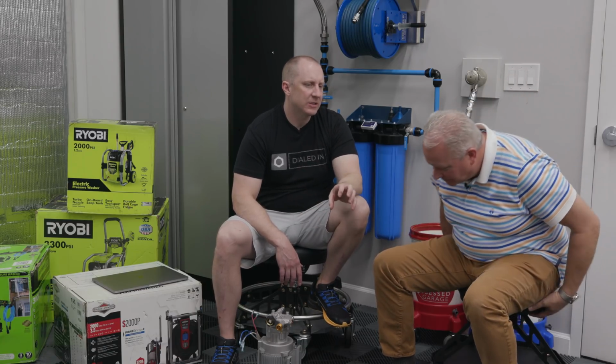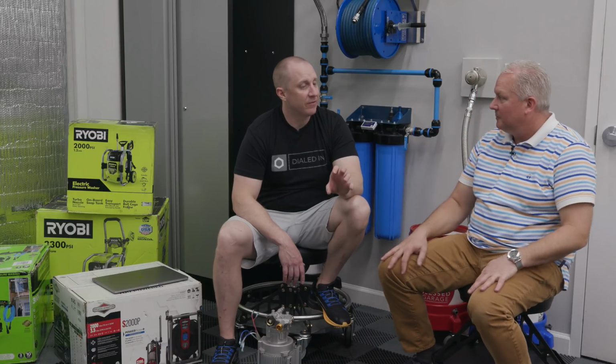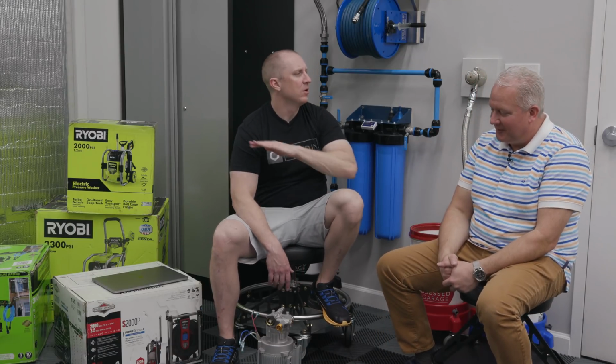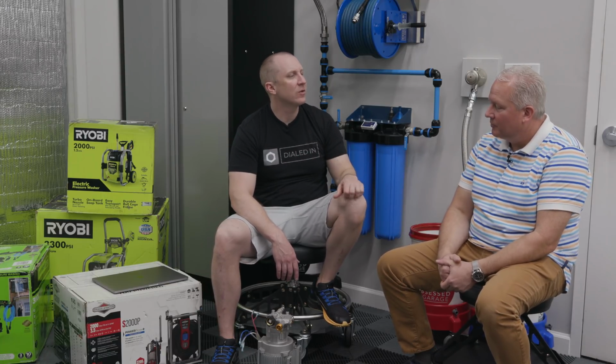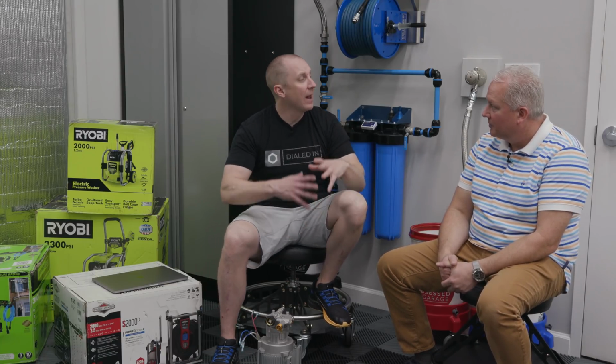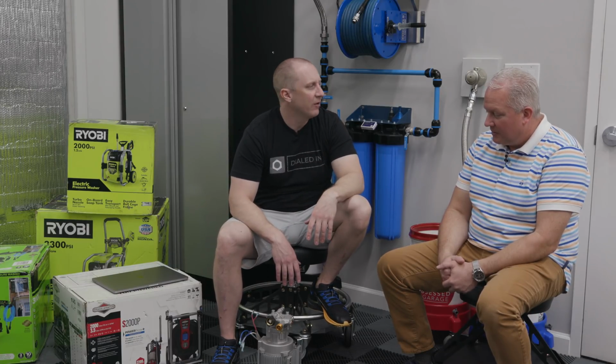So the quick disconnect couplers or plugs. What's the PWMA's recommendation on that? Because when I first started doing this, it was a no. No QCs. You're going to cause cavitation to your pumps. No one's supposed to use those, or no one will allow those, or we're voiding warranties if we use them. Now it's become a standard. Pretty much every pressure washer, you want to break it down, you want to clean it up, you want to maintain it. We just talked about what's the standard there.